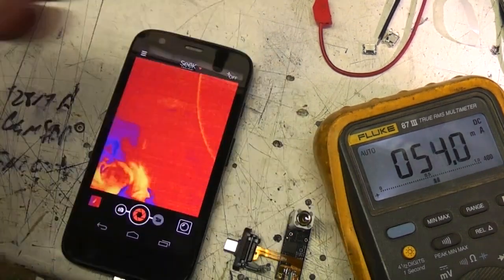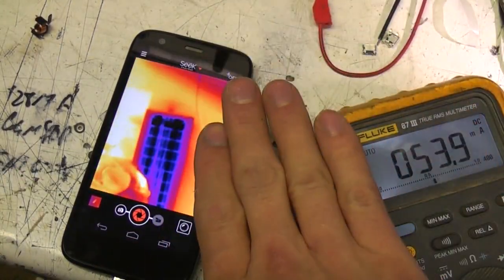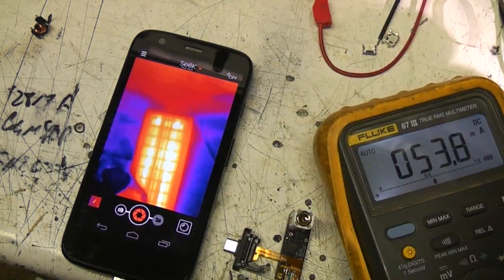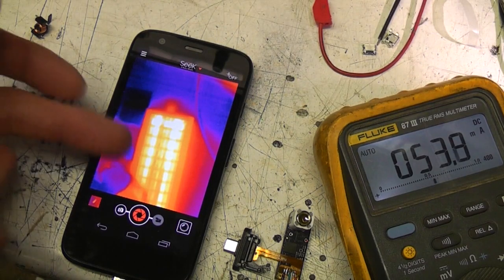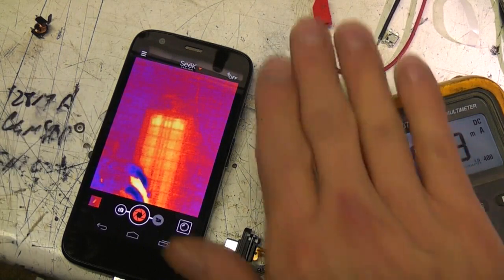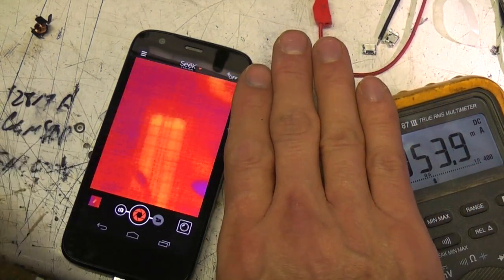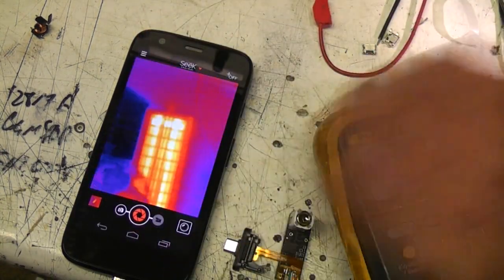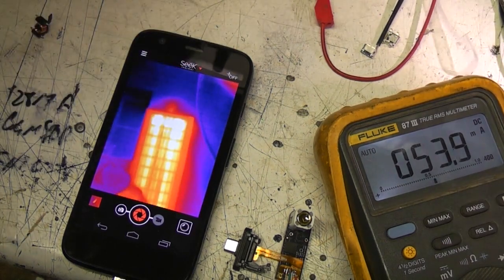I've removed the shutter, so the image is going a bit loopy because it's trying to calibrate and not doing so, you get all sorts of weird ghost images. So for example there we go. You don't actually see any indication on the screen, so it's obviously just done a calibration there because the screen just gone nuts. If I stick my hand in there, you now see the ghost image of the light. Now it's calibrated again against my hand, and again it will just go generally fairly nuts because it's calibrating against what it thinks is a flat image, but actually isn't.